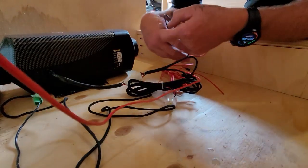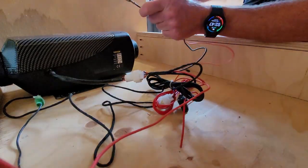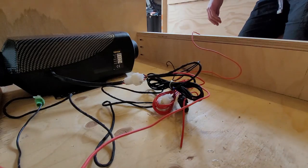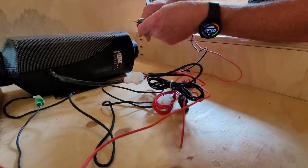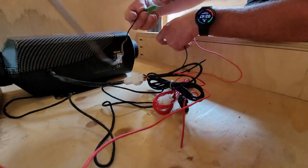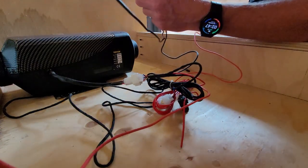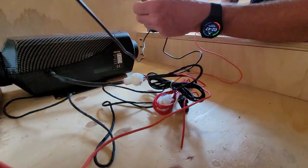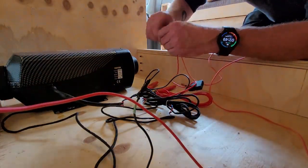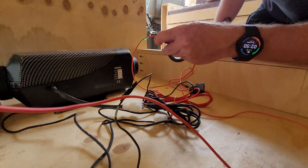Now I'm inside and I'm going to hook up the power. I've got a connection here — this is the ground. If you've watched any of our other videos, you'll know that I did a ground separate from the body of the bus. I did a common ground which I have right here. This one is labeled heater ground, and that's what this is — the heater. So that can come off. Okay, so that gives us the power connection.